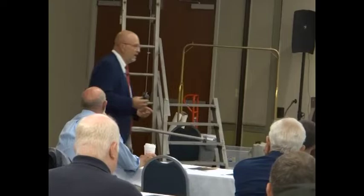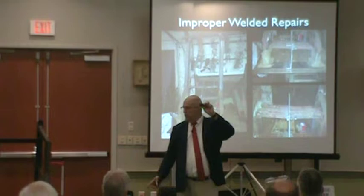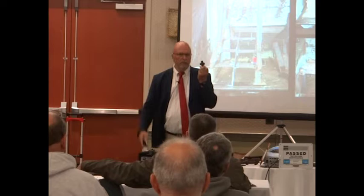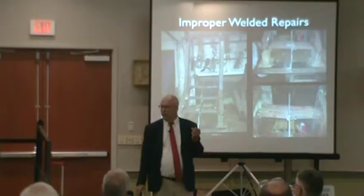And a lot of times, this is the best part. The best part is that you guys make the ornamentals, put in a 3/4 bolt. When this thing was removed, and that's why I kept it for this kind of show, they use a 1/4 inch, we call it the molly, not molly bolt, they call it the butterfly. So it goes in, opens up, and then grabs the sheathing. And a toggle, is it a toggle bolt? The toggle bolt is what holds a lot of these up. And the angles, instead of being 2 by 2 by 1/4 underneath, they're 1.5 inches by 3/16 inches. The angles that support these up.